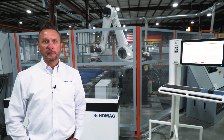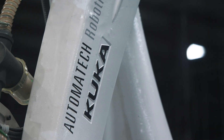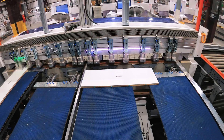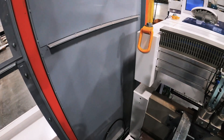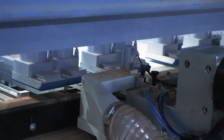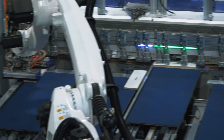Let's take a few minutes to review the three main technical components of the solution. Off to my left you can see the KUKA industrial robot with integrated vacuum end of arm tooling in the center of the cell. That's a shuttle table system designed to receive the parts from the robot then move them underneath the clamps on the drill tech machine to one of four zero points on the drill and dowel inserter. And back off to my right is the dowel insertion machine itself, custom integrated into that shuttle table system.